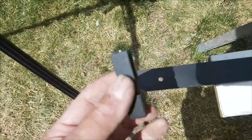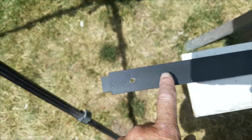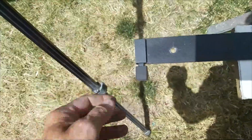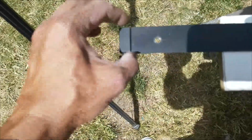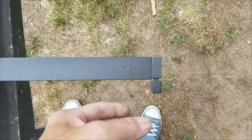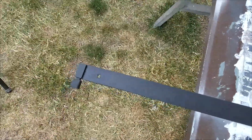Now here's the door bumpers. They're made for the cheesy flimsy 1-inch rail, while we're using a 1.5 inch. You can see I had to notch the ends there so I can stick this on there. That's for a door stop, and we just kind of centered it so it looks like it's all part of the system here. Okay, we got our bumpers installed on each end first. It's easier to do it now. Don't scratch up your finished wood.